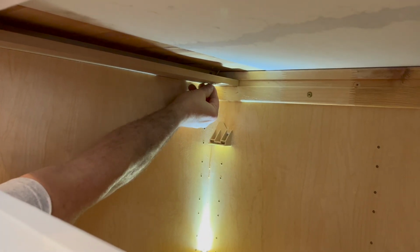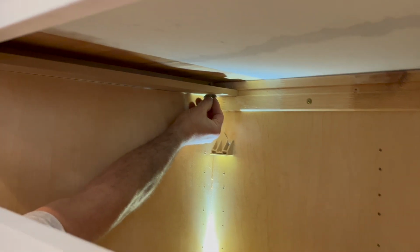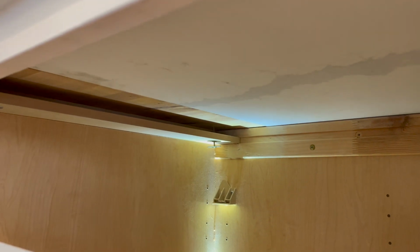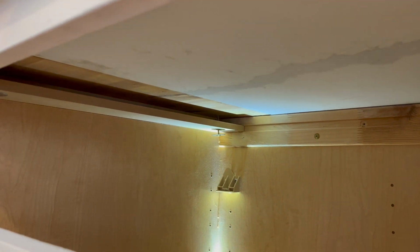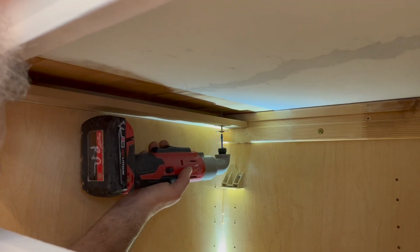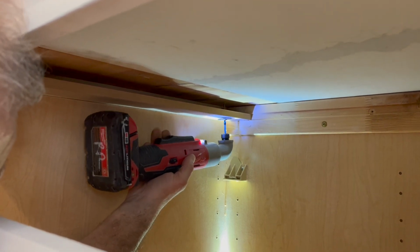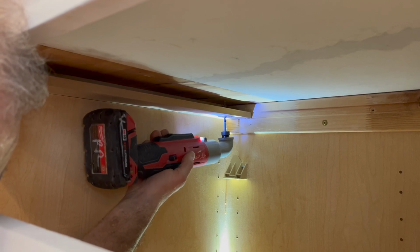One pro tip here is do not glue or silicone down your top. It will prevent expansion and can cause a warp or crack on your boards. Also, do not install it on, say, other countertops or directly on a solid surface such as plywood or MDF or something like that, because it prevents the board from breathing.